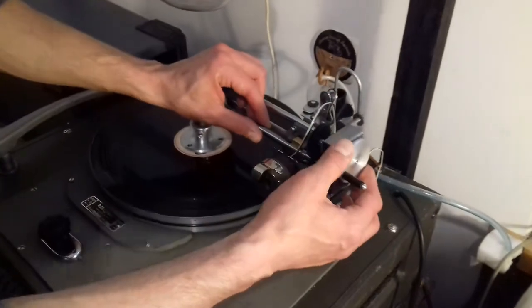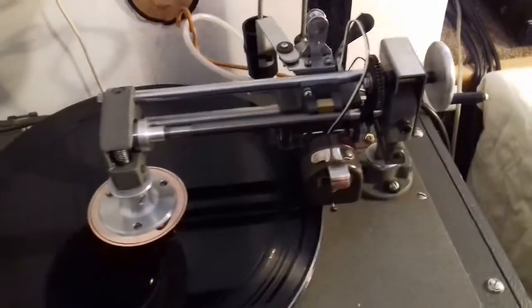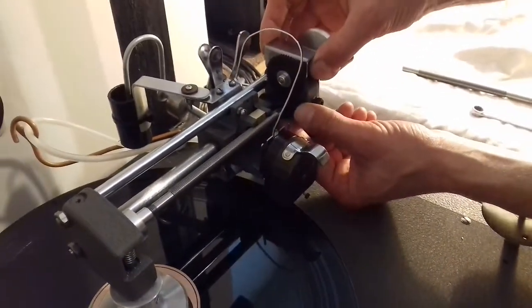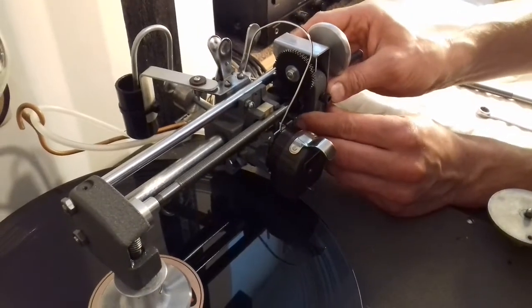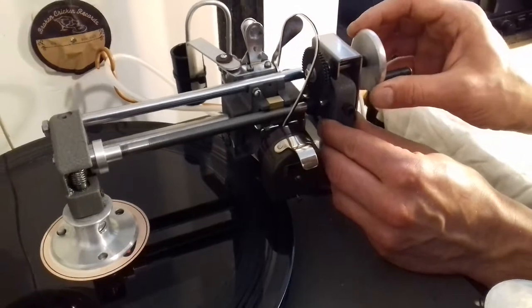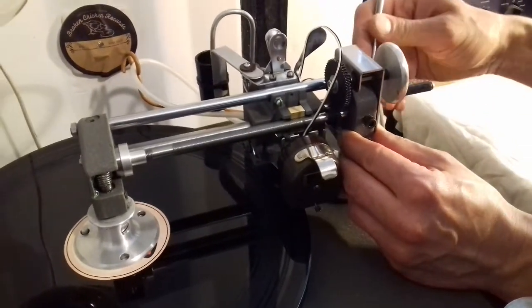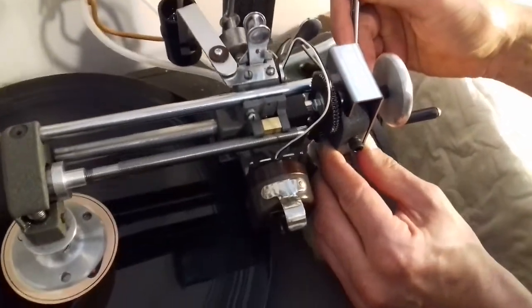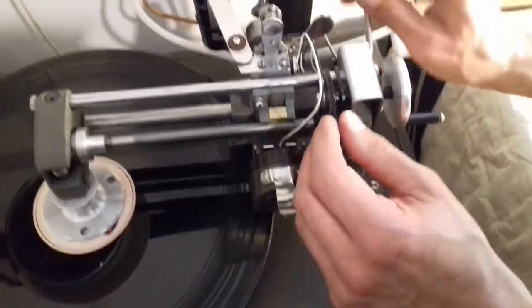Make sure there's a little play between the gears, because you can still move the crank up and down a bit. When you have found there is a bit of play, we may tighten the nuts. First one — the play is still there. That's good.